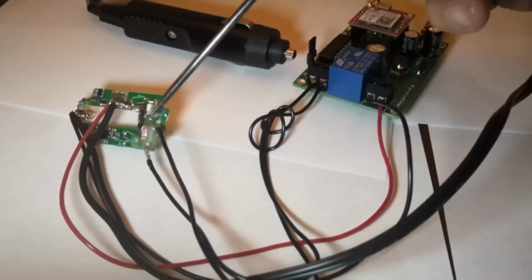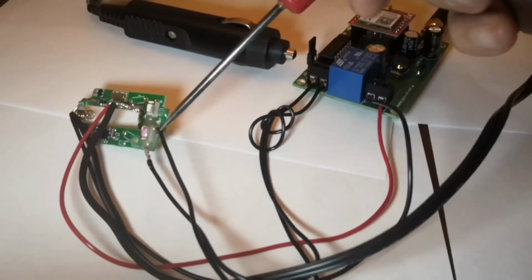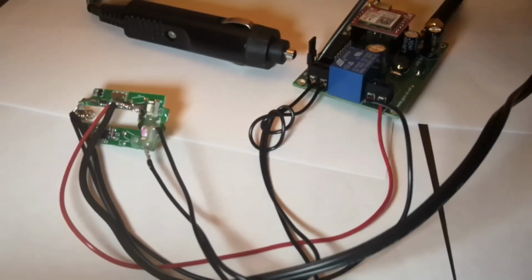So of course then the wires I took off of the remote control go into the GSM relay terminals there, and if you had the rotary, that would be the wires you tagged into the back of the rotary controller, goes into there. So now we're all good to go, I think, and what we need to do now is just program up that GSM controller. Okay, time to program up the controller then. Now what I would say is read the instructions, because they're actually very, very clear and they're in English, not Chinglish.